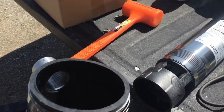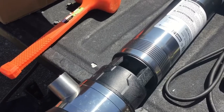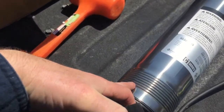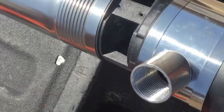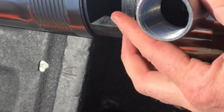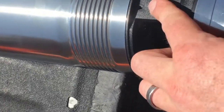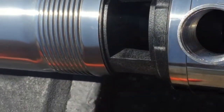Step three: now that the clamps are loosened and the sleeve is lubricated, we're going to slide this sleeve right over the bottom of the pump and lightly tap it with the rubber mallet to get it all the way up to the first ring on the bottom of the pump, so the black sleeve will be up to the first ring. As we put the intake sleeve on, we want to ensure that this threaded nipple goes in between the support posts, so we line it up so no post blocks the inlet, and then slide it onto the pump.